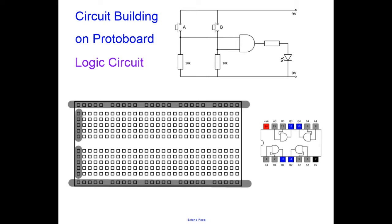You don't want to connect a component to itself, so the rules are that every component has to either cross the gap between the top positive rail and a vertical column, or cross the gap between the vertical columns at the top and bottom of the board — this part is called the trench. Or it has to cross the gap at the bottom between the column and the negative, or go sideways from one column to another. So there are only four ways you can connect components on the board.